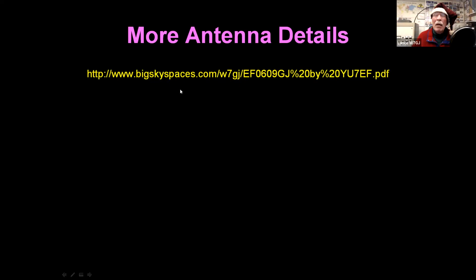So I have on my website a photograph of the antenna and the plots that I did for it last spring when I built the antenna. Basically, I used the 6M8GJ boom, and all but a couple inches were used by the 9-element design that Pop did for me, to come up with an antenna that was within a couple tenths of a dB of the same forward gain as a 6M8GJ, but with a lot greater bandwidth.